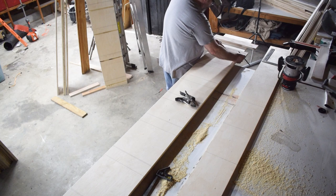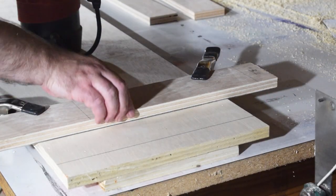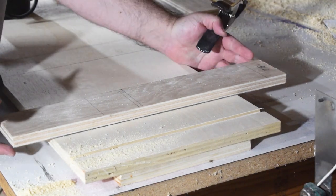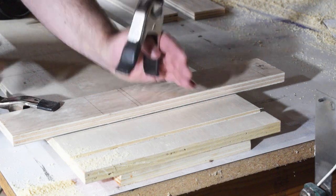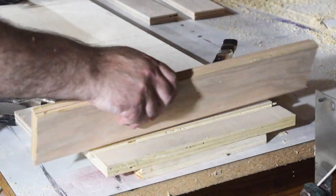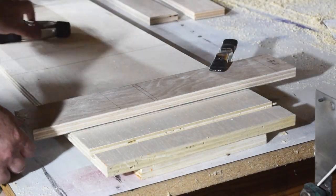That's why I have two boards that are a quarter inch apart — I make the first cut and then make another pass a quarter inch past it to get my three-quarter inch dado. Where I drew the line is three inches away from where I need to cut, accounting for the width of the bit. Then I move the board to that second line, a quarter inch further away, and make the second pass which finishes out the three-quarter inch dado. The best idea is to err on the side of being too small, then tap the board over to finish out the dado to a tight fit.